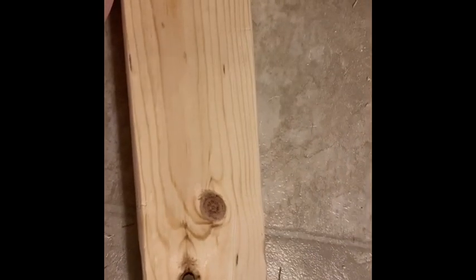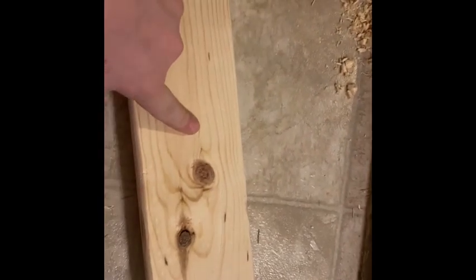The holes that I drilled in here are for the header for this wall, for the cords that are coming through the ceiling there. So I went ahead and drilled those holes. And then I have this piece, which is pre-cut. You have screws in it still, which I'm going to take out quick. But this is going to be the first stud that we put in place. So what I'm going to do is I'm going to screw this to the header before we put the header up, just to help give it a little bit of extra support while we get it in place.